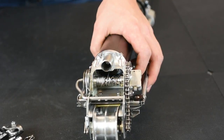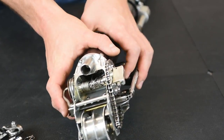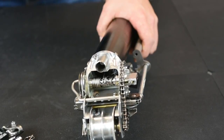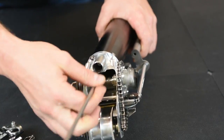Once you have the cap open, put your taper into neutral by putting your mud gate over your push rod. That allows the taper to run in neutral. Take your push rod, whatever you're going to use, push your plunger to the bottom of the taper.